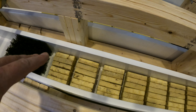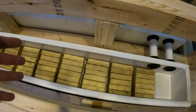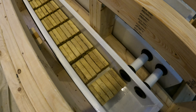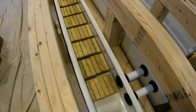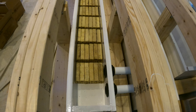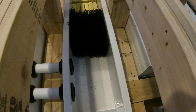Next, the water comes down to our aerobic bacteria area. This is all ceramic block — very porous with holes through the middle — so the water will move all the way through this massive amount of ceramic block. This section will house aerobic bacteria, which use oxygen, ammonia, and nitrite as fuel. The byproduct is nitrate, and then the water comes through two 2-inch pipes into the next filter box.